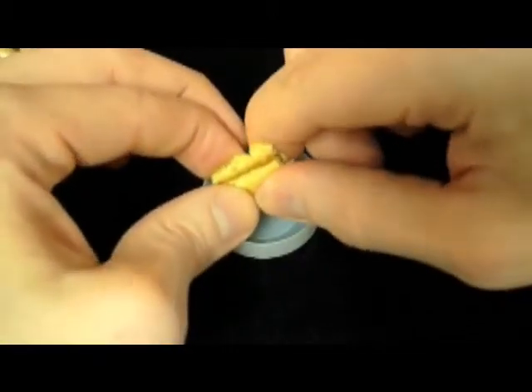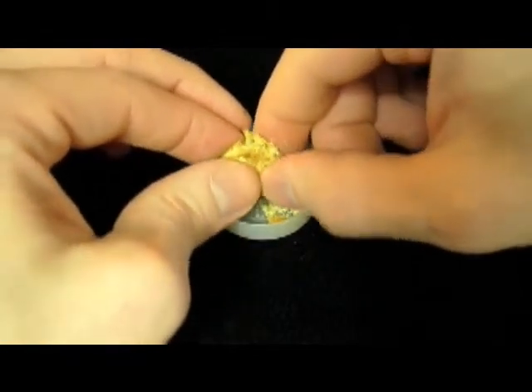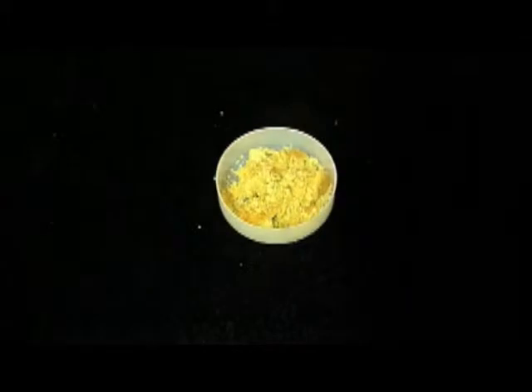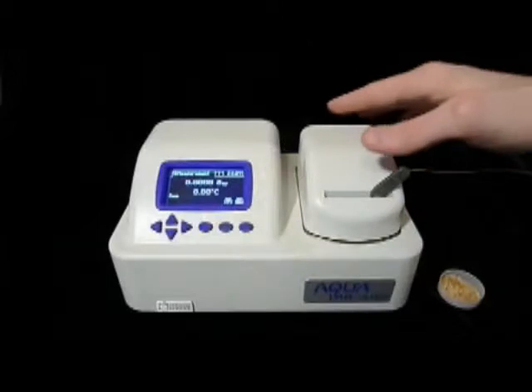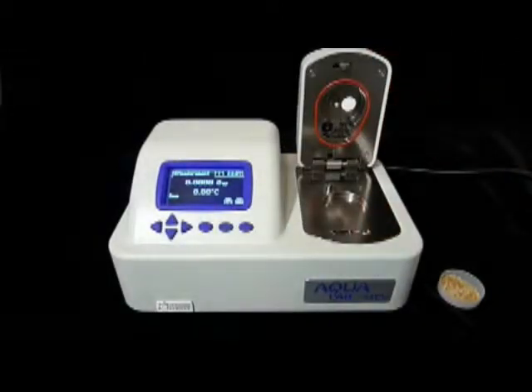Since I want to take a reading on this graham cracker-like product, I'll crumble it carefully into the sample cup, making sure that the bottom of the sample cup is completely covered and that the cup itself is not more than half full. Unlatch the sample chamber by pulling the chamber lock lever to the right. Holding the lever to the right, lift the chamber lid. You can see a number of sensors recessed underneath the lid. The Series 4 makes these sensors much easier to monitor and keep clean, but be careful not to touch them or to leave the lid open longer than you need to.